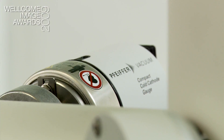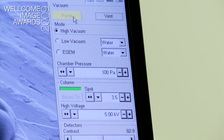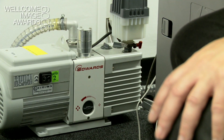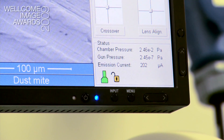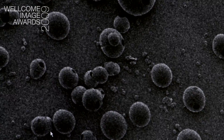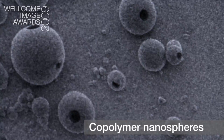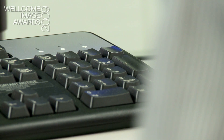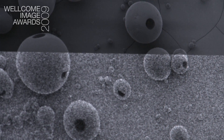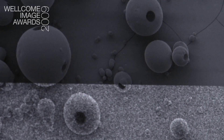We're going to go into high vacuum mode and pump — you would hear the pumps come on. So I'm going to switch on the beam. Here are the polymers. Now it's in focus but it's very noisy, so I'm going to slow the beam down. If I just press that one there, you can see just how much that improves by slowing the beam down.